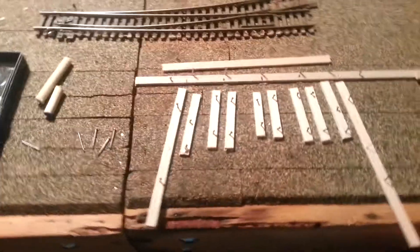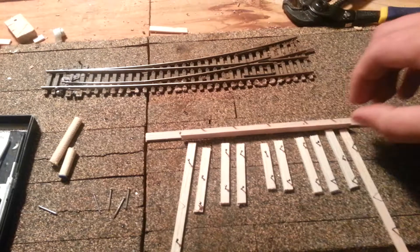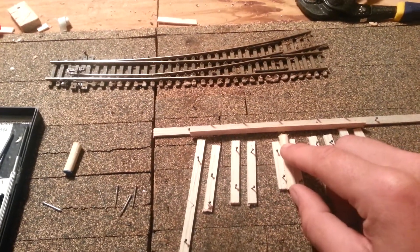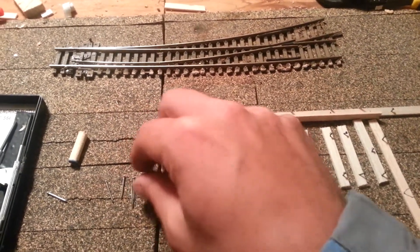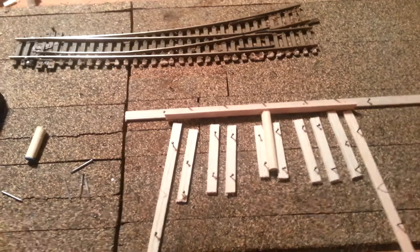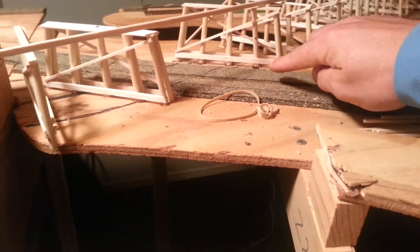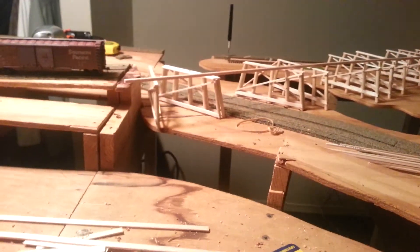If I can give you an idea of how I did this, I built a template. I would put the top board here and set dowels in these. I would glue the tops, let it set for a second, then push it forward and pin the dowels in. That held really good. Once that's set, I'd set the baseboard down there, then run the cross up here, let that dry, spin it around, and finish the other side.